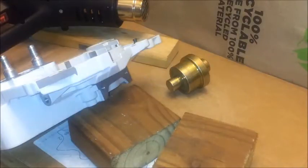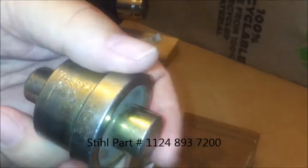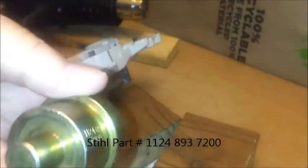When you find that you need to put the bearing in a crankcase like this, the bearing is really tight, and there's a few ways you can do it. This is a low cost tool. Actually, it's a steel tool, and it's heavy, and that sucker will drive it in. And then of course you make it so much easier with a heat gun.